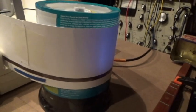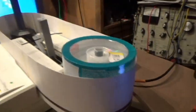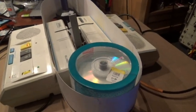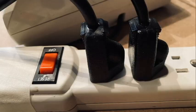You'll hear some lo-fi wonkiness because the machines are competing with each other, but see if you can hear where the splices are. In this application, the loop needs to be anchored on either side to keep it moving. I also need to turn both machines on at the same time, so I plugged them into a power strip and used the power switch on the strip to engage the machines.